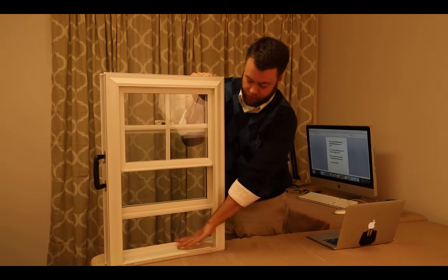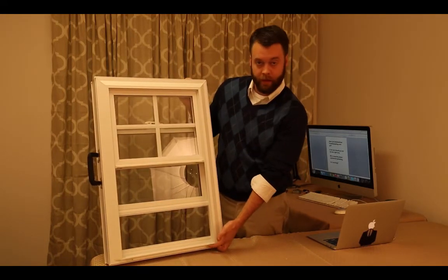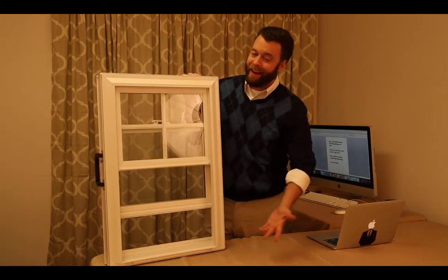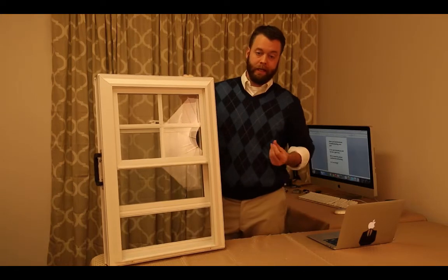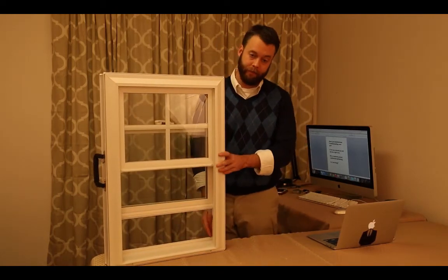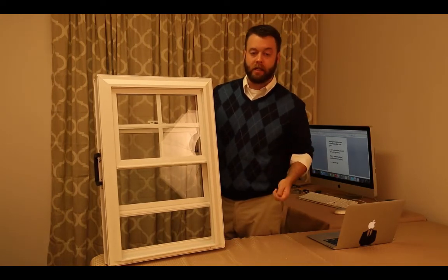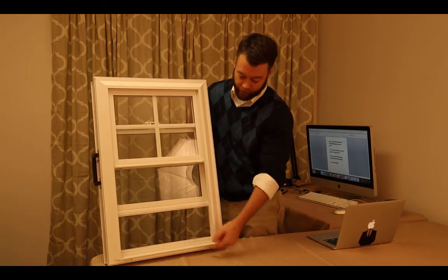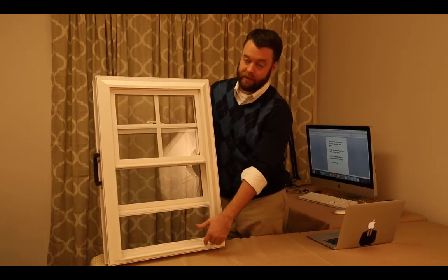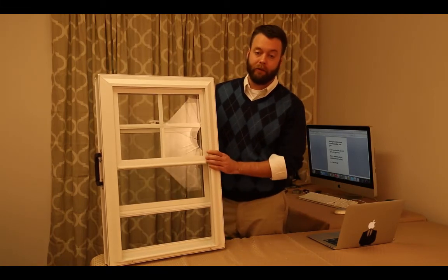On the outside we've got a slope sill, so any rainwater that comes in will just run out — that's a pretty standard feature nowadays. This is a slightly older design in that it still uses weep holes — you can see the little hole down here. Any water that gets into the frame through the tracks drains through the frame and out the bottom. We have seen service calls where these weep holes get full of spider webs, leaves, twigs, and dirt, and then they don't drain properly. In a hard driving rain, the frame fills up with water and if it can't drain to the outside, it'll leak to the inside. The better solution is a fully welded sill that most newer windows have, where it's completely sealed so there's no way for water to get in at all — these older Fusion designs do not have that.